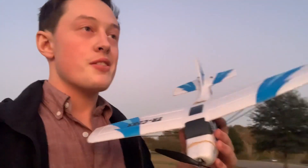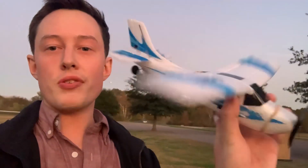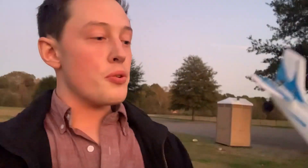But here is the thing. I had to mess with this plane a little bit to get it to work. These gyroscopes were not rigidly mounted into the plane when I got it. And that proved to be a problem because all of the control stuff — this is a very cheap plane — is mounted inside the main fuselage, kind of right where the middle window is. All of these servos are mounted on this one board, and the rod that connects to the rudder — you can see a little bend in there. If the mount point for that servo isn't rigid, the rod will bend. So I hot glued the PCB down into the plane.